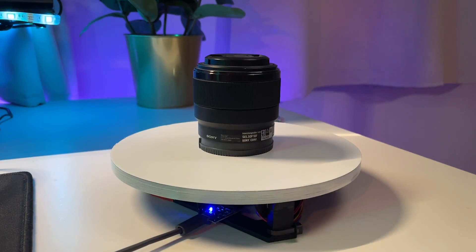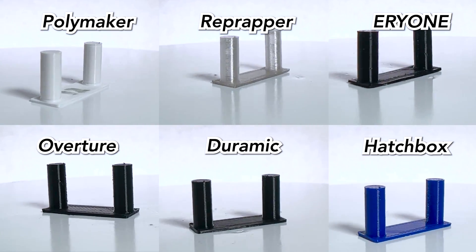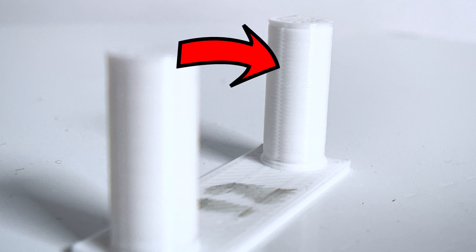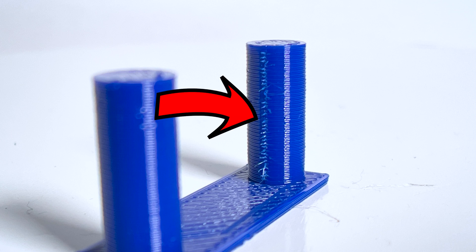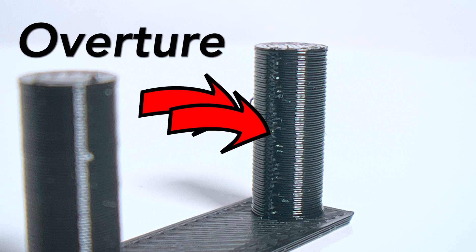It's been a day or two since I filmed the first part of this video, but now I've got all the benchies printed as well. I printed a moving tabletop, and you'll see that as I show shots of the different benchies. Starting off with the six millimeter posts, we're going to compare all six and see what the difference is. I'm looking for filament strands or strings hanging off or bridging across from one tower to the next. Out of all six, the Polymaker is the only one that doesn't have any signs of filament strings hanging off the inside edge of the circles. The rest, including the Hatchbox at $36.99, also have stringing.